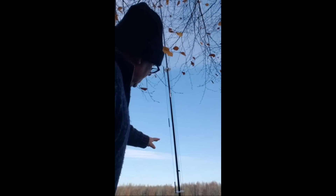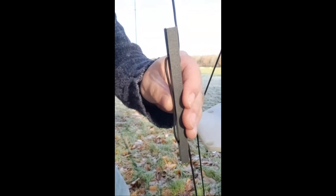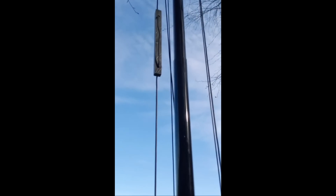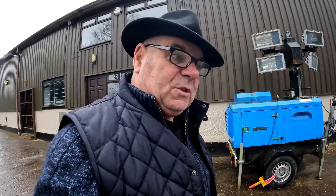So what we've got here is some blocks of new plastic that I'm testing out. We'll do a high power test back in the shack and I'm live streaming this to my PC in the shack. Basically we're going to look for smoke — which incidentally it didn't blow up and didn't melt. But all of a sudden I got some high SWR, probably something to do with the way I put the connectors on, because the SWR went up the swanny. I was running just over 1600 watts into this and the SWR went about two to one.